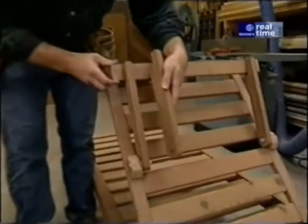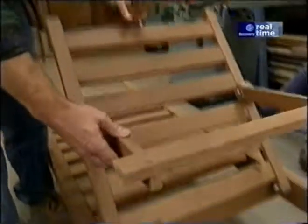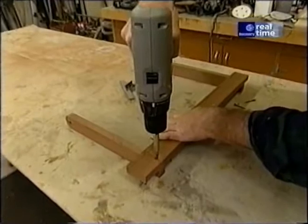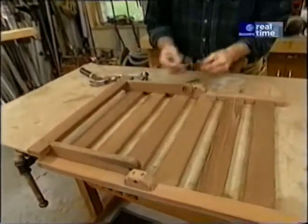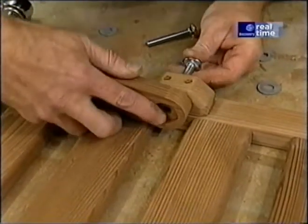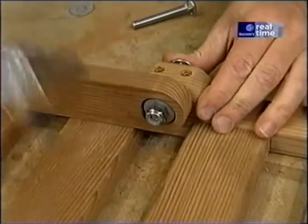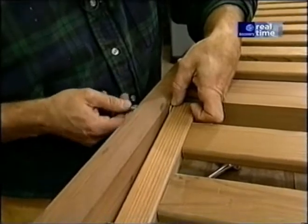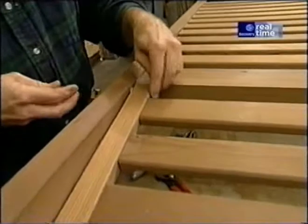This is one of the three pieces that makes up the backrest support assembly. I've nibbled away a notch which receives this cross piece — once assembled it holds up the backrest. We'll secure these pieces together with some bronze screws. To attach the adjustment arm assembly to the backrest I'm using a three-eighths-inch carriage bolt through the little block, a washer as a spacer, aligned through both holes, another washer, and a three-eighths-inch locking nut. The backrest gets attached to the base of the lounge with a slightly longer carriage bolt, another washer as a spacer, all the way through, with one more washer and another locking nut.